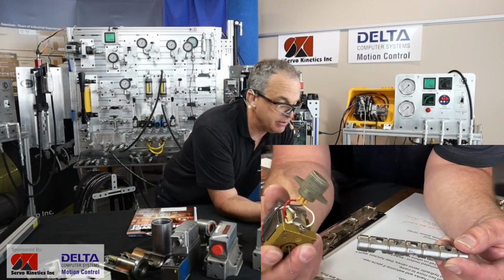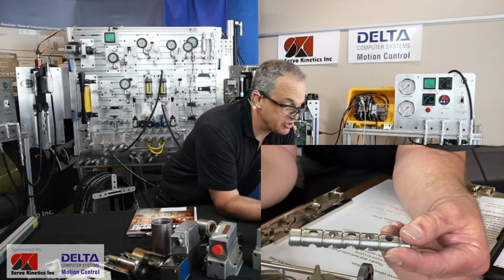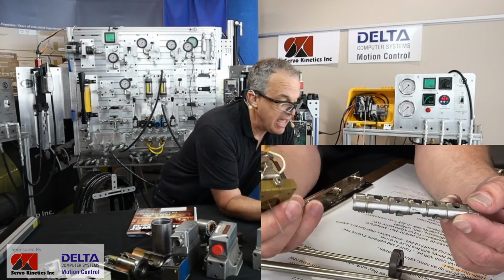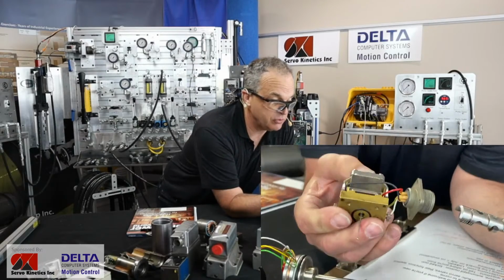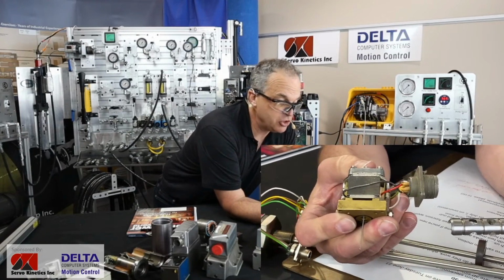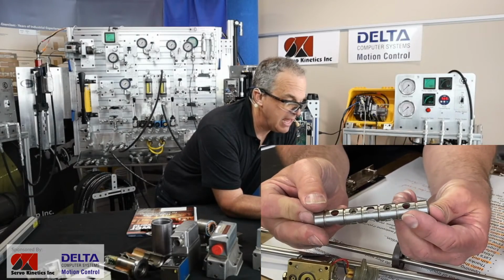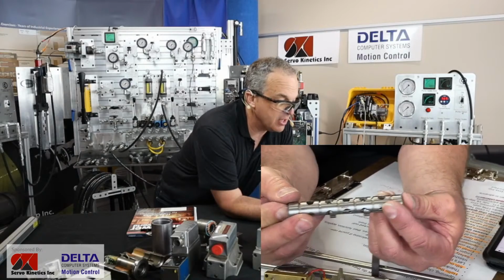And if it lags behind the signal we sent to the valve, then we're looking at an issue where the valve is not necessarily staying in phase. The output of the valve is not staying in phase with the input command. And also the amplitude, meaning how much flow came out versus the signal that we sent. And so what happens in frequency response testing is they send a sine wave, and this is done, of course, by the manufacturers, who then publish the capabilities of the valve after they've designed it and achieved the best results they can with a particular design. They'll let you know how many back and forth sine wave drive signals you can send to this valve per second. That's your frequency. How many full oscillations back and forth can you send and expect this spool to keep up and be in the position desired and produce the amount of flow desired, matching the sine wave input signal?